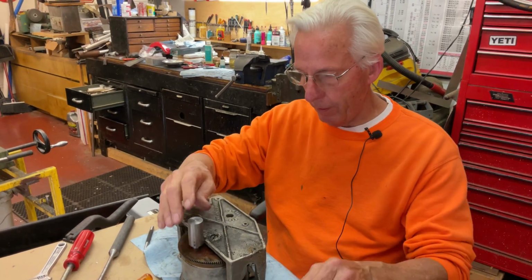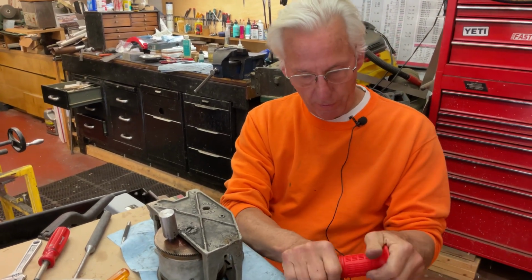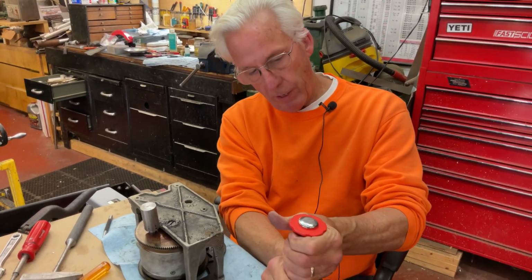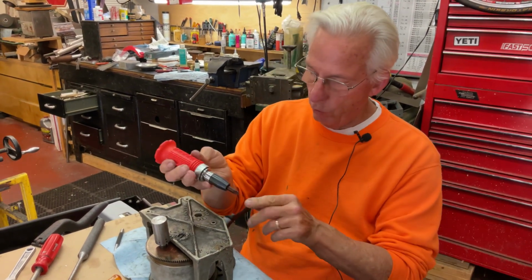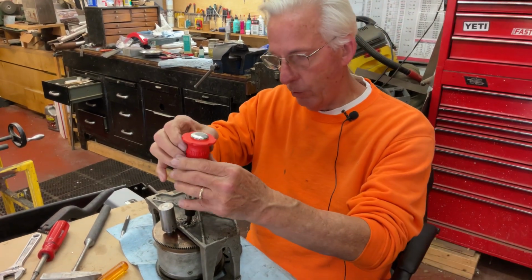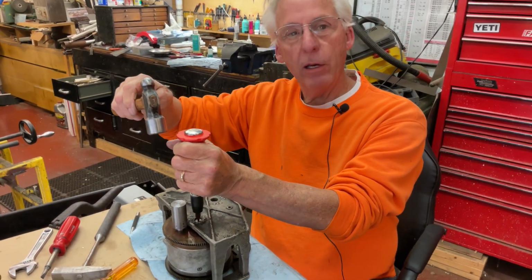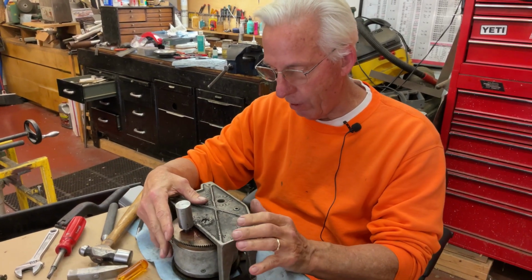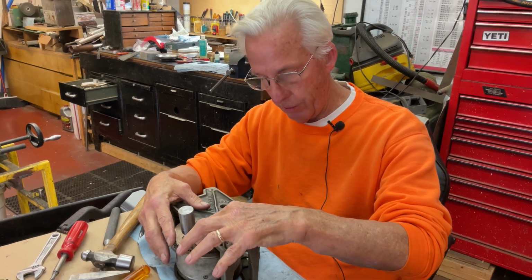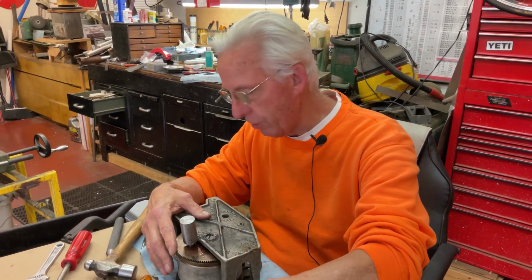So I took this and I locked this down. And these tools, this red piece here pivots a little. It has a tension. So you're beating down on this and this is moving like this. It gives it tension, then it'll break loose. But that way you can hold the flat edge into here. So what I did first was I beat this way to tighten it. Then I went here, and you can see how this turns, and now it locks against the casting. It doesn't hurt the gear. Now we can take this out. And you got it to finally break loose. I finally got it to break loose.